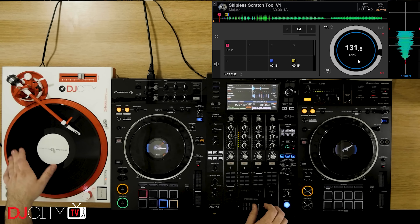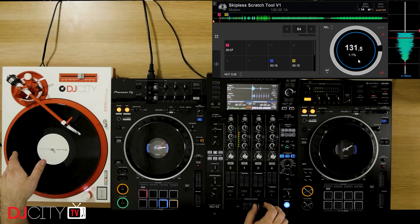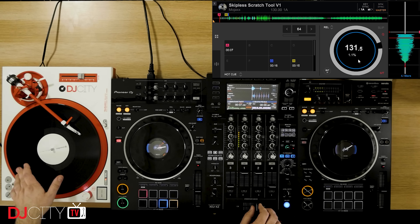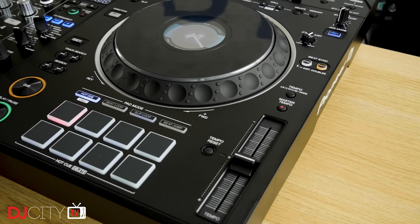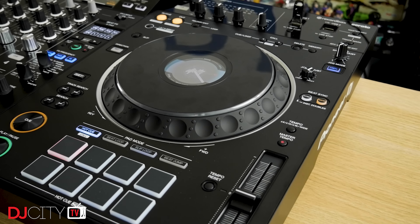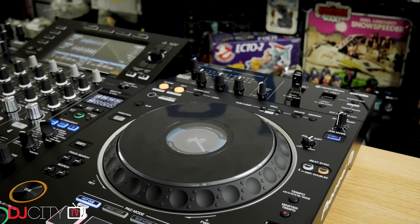I need to spend a bit of time with the software side of things in Rekordbox to really get my head around it. It comes with a performance license for the software and it does support DVS, but you'll need to buy the extra license for that. However, although the XZ has four mixer channels, only the outer two have any inputs, and the software automatically routed my turntables to the two main decks in Rekordbox. The big thing to note is that the deck sections on the XZ do not have deck selection switches, so unless Pioneer DJ and Serato add something to their software, there doesn't seem likely to be any way to control decks 3 and 4 from the unit itself — something I will have to play with more.